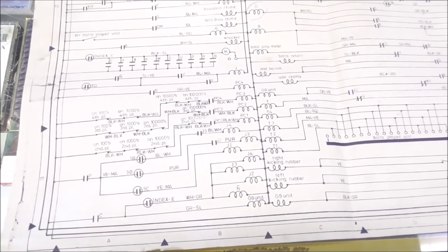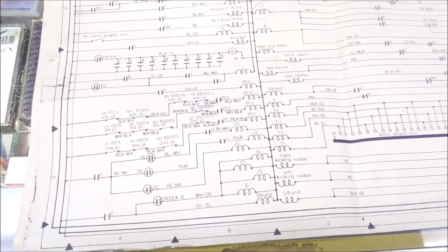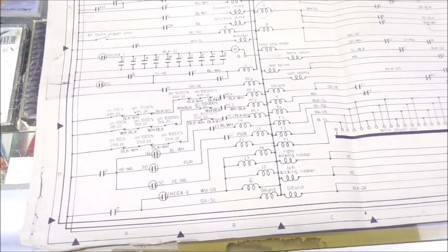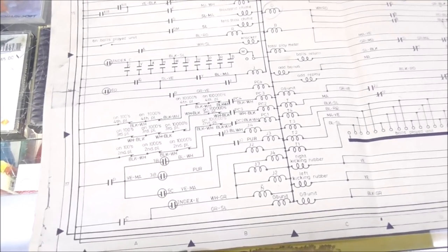Okay, so I'm going to go back to the score motor. I'm going to clean all of those switches, and I'm going to see the same thing. You got to clean them, and I'm going to carefully watch them and make sure that all of them seem to be closing or opening, and especially pay attention to the top ones because they're the most likely to get bent out of place like that one was.